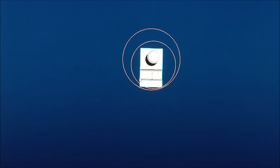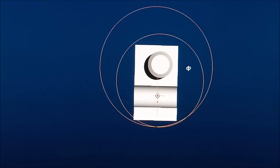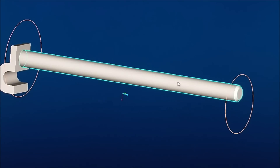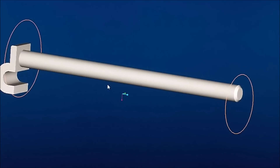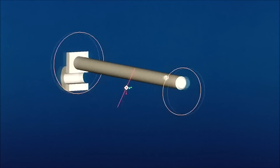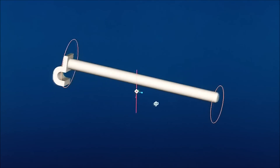There's an alternate opportunity: the smaller circle in the front is the eccentric. If we were to turn the smaller diameter eccentric in an eccentric collet, we could use smaller diameter material — a material savings for sure. But this part is so long that as you extend the material, the chances of it running out of the eccentric location and developing a mild cam between cuts is very high. So you either risk screwing something up because you can't maintain position in the eccentric collet, or you waste 85% of the material. What is the solution?